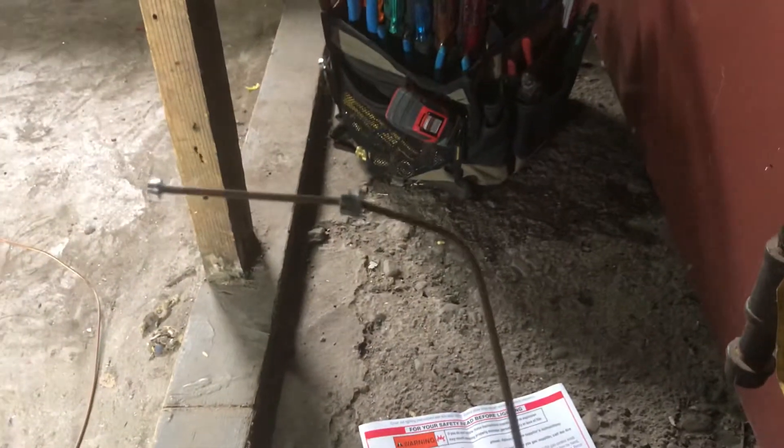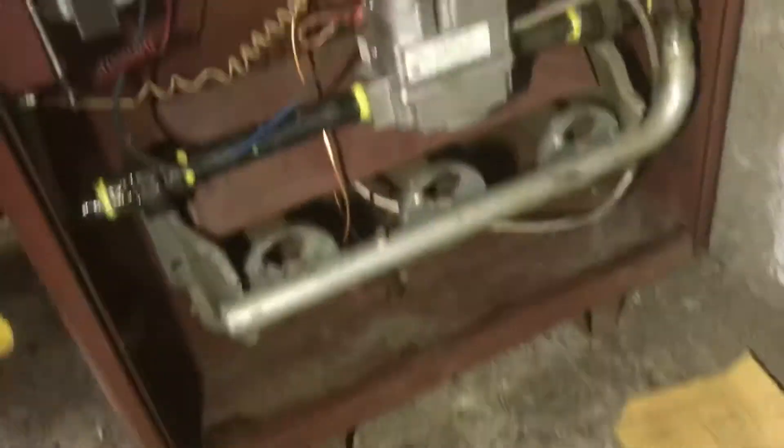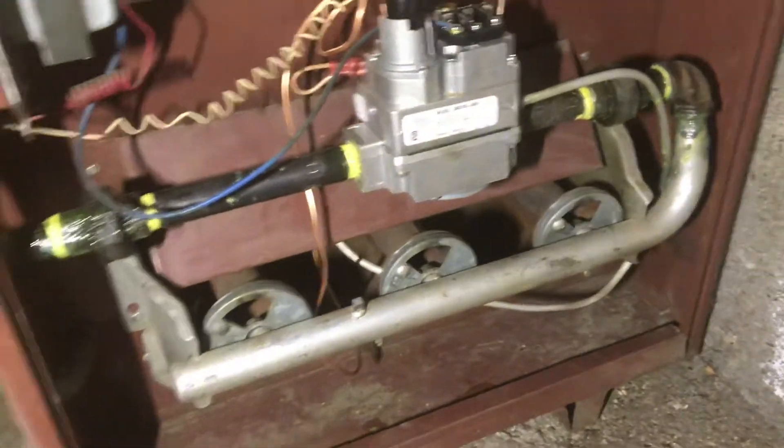Here's another part of the original gas valve slash gas train — the regulator vent. The old gas valves were engineered so that if the regulator fails, it vents into the combustion chamber to burn off any excess gas. That's the original vent tube — it came off the original gas valve. 57 years old, and the only reason I ever had to replace it was because it was leaking past the pilot assembly portion of that gas valve.